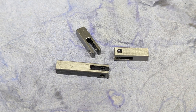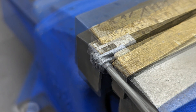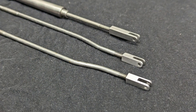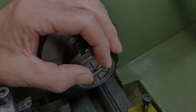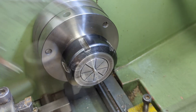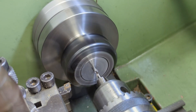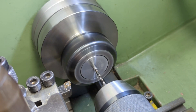The pull rods are quite long at 467mm. On each there are three sections threaded at 2BA, which align with the brake beams, and the rear end of each rod is threaded at 5/32 x 32 TPI.